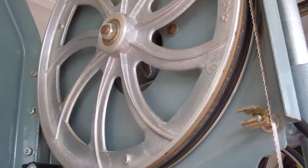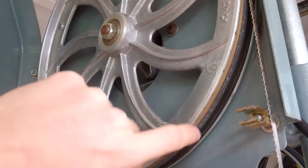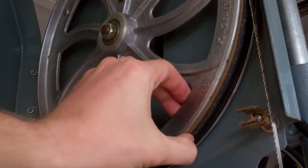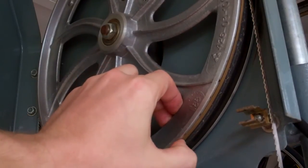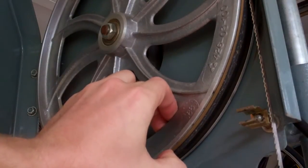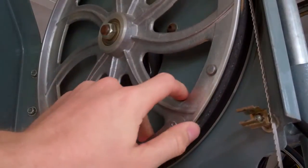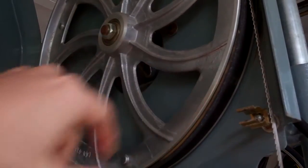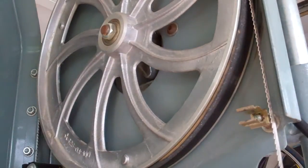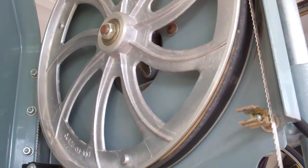Here's the upper wheel and you can see most of the tire is black, but where the blade is tracking, the black rubber is kind of wearing off a little bit and it's turning yellow. It is absolutely yellow on the edge, which I think is not normal. Down here you can see it's black in some parts but yellow in others where it's kind of rubbed off. Generally speaking, that upper tire looks pretty good except for the discoloration.